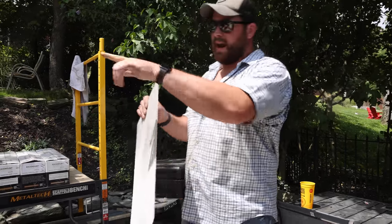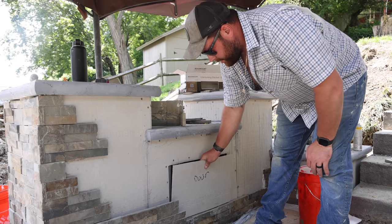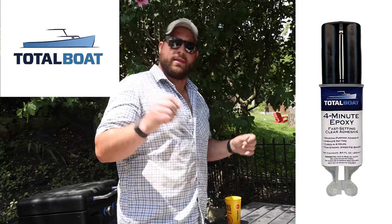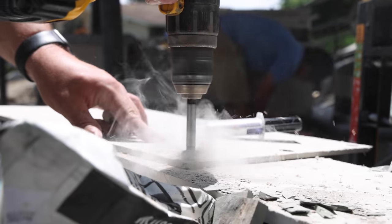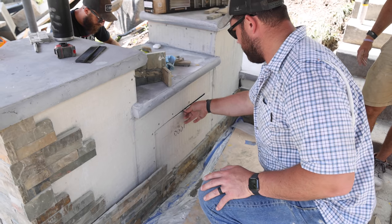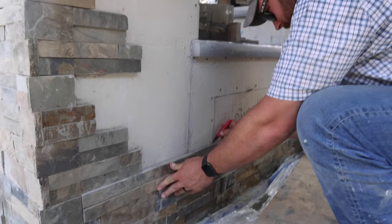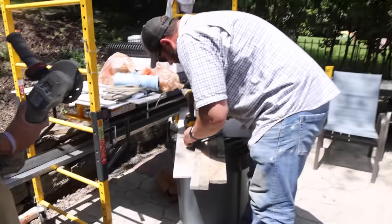To do this hidden door, we've got the cutout piece from the front. My thought is to keep working across and then cut vertically where the door is going to land — that should make it easy to pop out and hide pretty decently. But first I've got to make the door attach to the interior frame. To do that, we've got neodymium magnets and some four-minute epoxy from TotalBoat. The only thing I'm concerned about is if it's too heavy with the stone on — these magnets are pretty strong, though. We're going to get these sunk in and then test it out. The magnets are on, which means this should, in theory, go where it's supposed to. I can mark the next piece and use our square to mark a straight line, then put both pieces on — one on the door, one on the wall — and they should fit together.